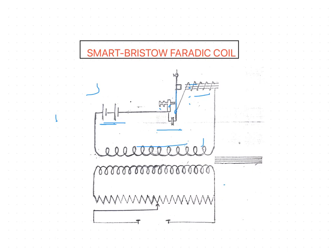The soft iron head of the hammer lies opposite to the core of a small electromagnet, which is separated from the primary coil. The limb of the hammer is prolonged beyond the head — this is a modification not seen in the Lewis Jones coil. On this extended part there is an adjustable weight, which enables the speed of vibration to be altered. The tip of the screw and the point of the limb of the hammer where contact is made are faced with platinum or tungsten — hard metals that resist the wear from sparking and continual vibration.